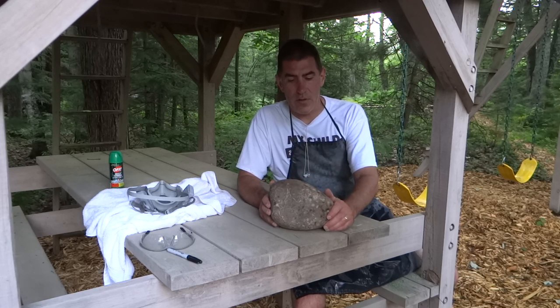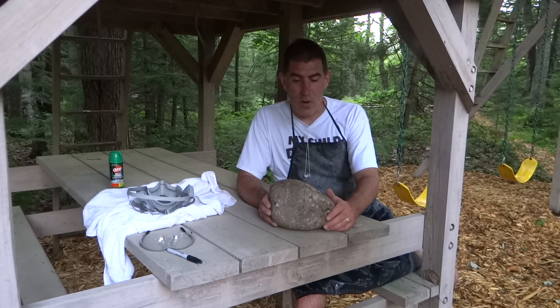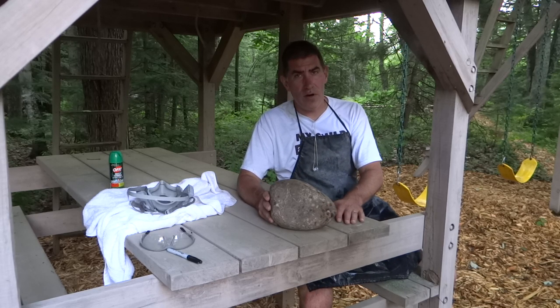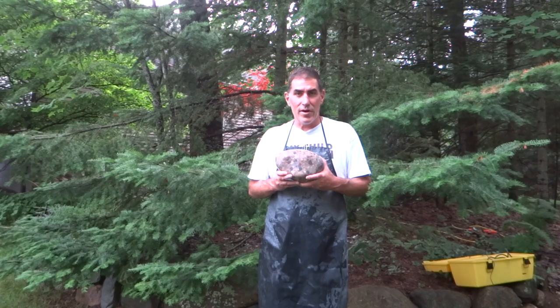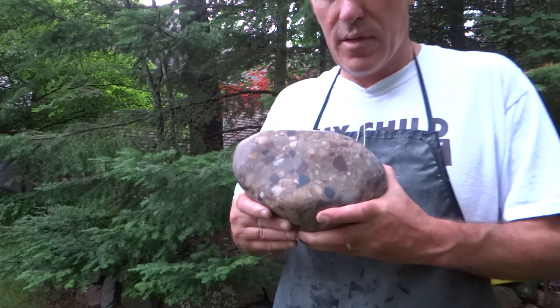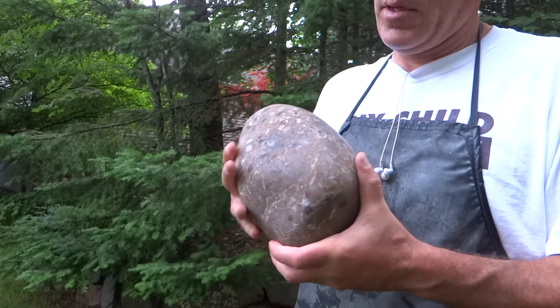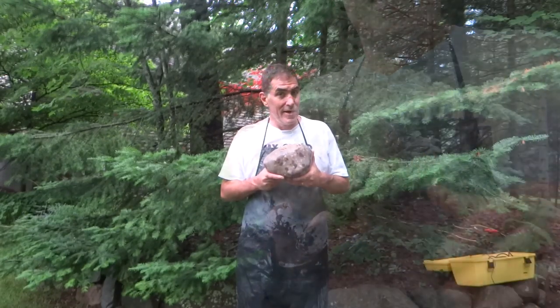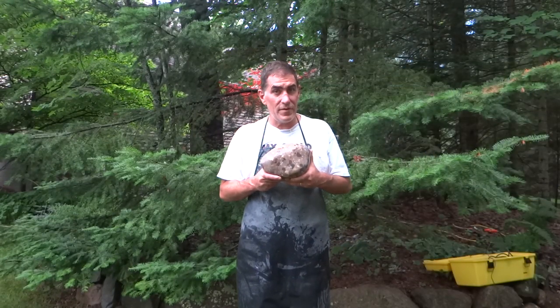But that's why it's important to dry it off in between and look at it. If I do miss any spots, they usually show up pretty well once it's dry. They don't show up at all when it's wet. So, what did I say I'm on? 200? 400's next. 400 is done and 800's up next. Looking good. It's done with 800 and moving on to 1500.